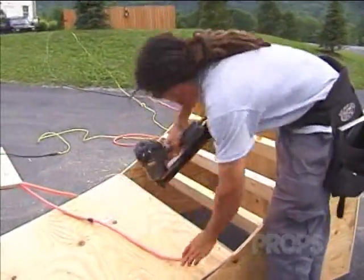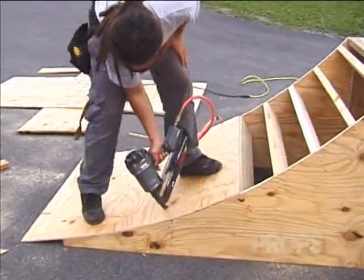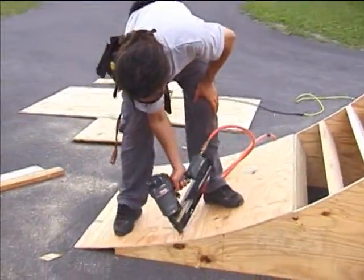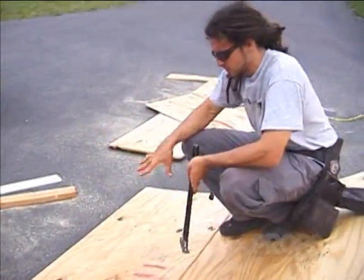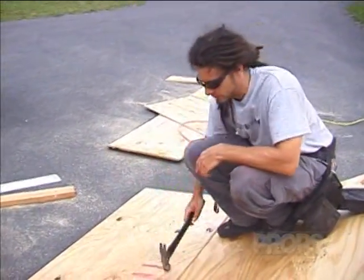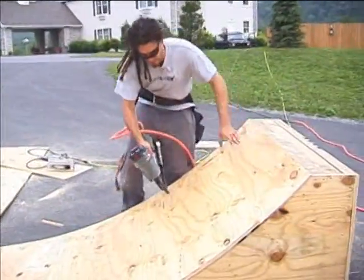Pop a couple nails in. And then you can just look on the side of your ramp where your ribs are at. That's pretty simple, you don't have to measure. Second layer, and smaller pieces of wood like this, I'll go over every single nail to make sure it's getting sucked down. I'll do one more row, my second layer.